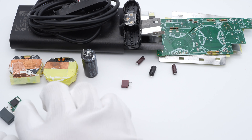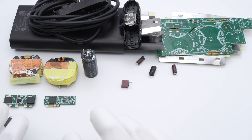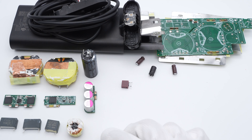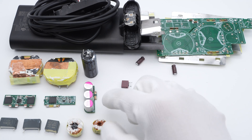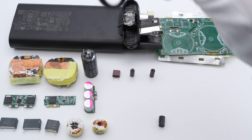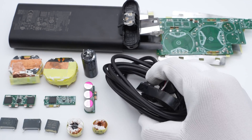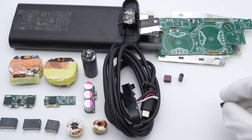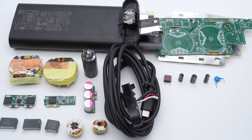That covers all the components of the 165W power adapter from Dell. You can not only charge Dell laptops at 165W through the proprietary protocol, but also charge other supported devices at 140W through PD 3.1. To continuously output high power for a long time, the PCBA is filled with potting compound and wrapped with aluminum plates to enhance heat dissipation. The small PCBs are vertically soldered, and most capacitors are placed horizontally to save space. It follows the consistently high quality of Dell chargers, and more components allow it to have better performance.